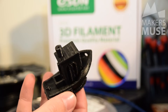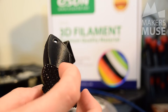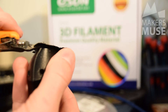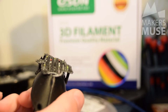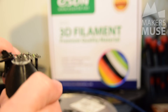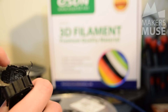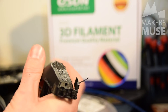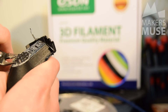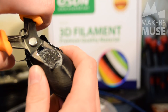I used the temperature mod to change the extruding temperature to 240°C after the third layer, and there is a clear difference in quality for this piece. It wasn't spitting and bubbling; the edges look nice and clean. But the raft was still very hard to remove, showing that the eSun ABS needs very low melting temperatures — possibly lower than most other ABSs on the market. At 240°C it's a far bigger improvement, but still not enough, which prompted me to drop the temperature further and do another test at 220°C.